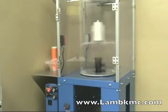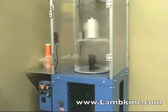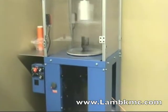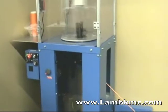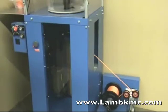Since 1 feed of yarn is mounted outboard of the revolving platform, while the second yarn spool is mounted precisely over the platform center, we are able to attain speeds of 400 RPM, which produces 800 courses per minute on this 2-feed machine.